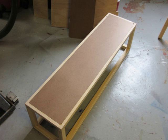And then I lay the first long side into the first stringer to the degree possible. It won't completely lay in because the ends are too long. But you get that aligned nice and tight, and then start making marks where the actual inlay is. And then go back and cut it. And I do one side at a time and slowly work it in until all four sides are cut and fitting perfectly with the inlay.